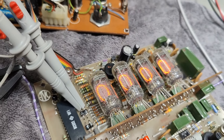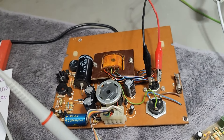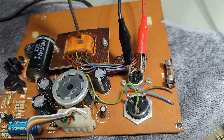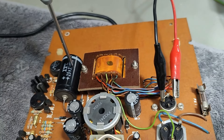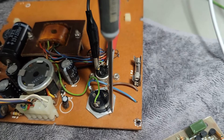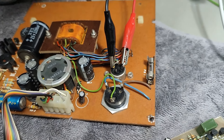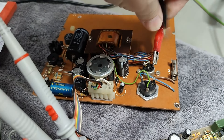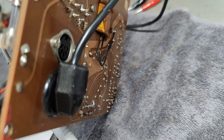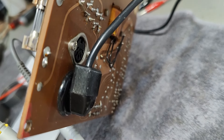So there's nothing I can do to save this unit, unfortunately, which is a really, really shame because I think this is a super funny unit. About the power supply - this is a mains input and it goes of course to this transformer. There's a rectifier and a main capacitor, so this voltage here is about 12 volts, and it also goes to this Dean connector here. So if you don't want mains voltage to be applied, you can just give it 12 volts of DC. And the idea with the mains connector going that way is to prevent you from accessing this connector while this connector is in - so it's either one but not both.